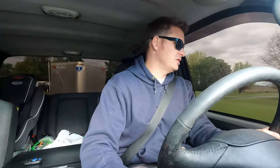And that's how I'm trying to be as efficient as possible, not have to run back and forth, back and forth. So these last two, what I'm gonna do instead is I'm gonna put a little bead of glue, push it down, and then I'm gonna use Tapcons pre-drilled with a countersink, and then attach it to the subfloor, and then fill it with a wood plug. That's the idea that I came up with. I think it's gonna look good. The transition strips look really good. They're almost identical to the floor, and the tile is like those wood-looking plank tiles. So that's what I'm going to do today.